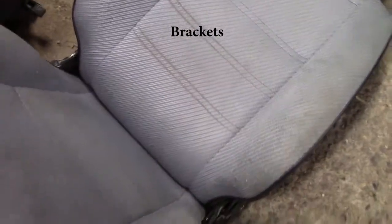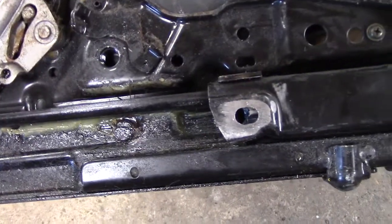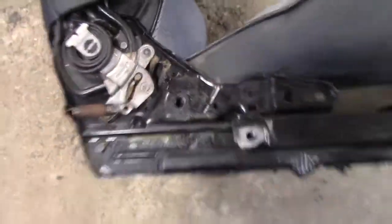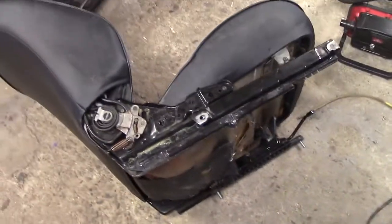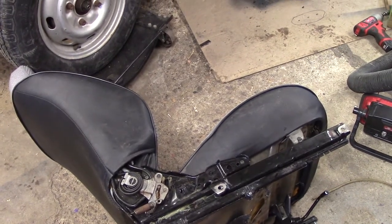On the seat, I cut the old tracks off. I drilled the holes and kind of craftily welded — it's hard to get in there with the welder, but it's more to keep it from spinning. Welded bolt there, another bolt on the back side, and that's the outside edge. On this side it just has holes in it. Now I've got all the covers for this as well. So let's bolt them in and see the result, and we'll see if that outside cover even fits on it.